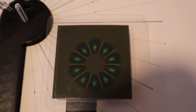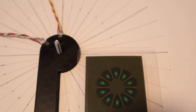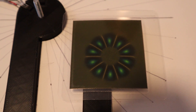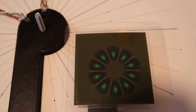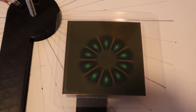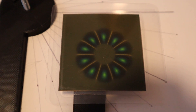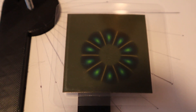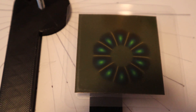You can see that the magnetic field has been divided into 10 segments. The yellow line represents minimum output from one of the Hall effect transistors, and the greeny colored spots represent maximum output if a Hall effect transistor goes over it.